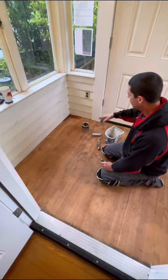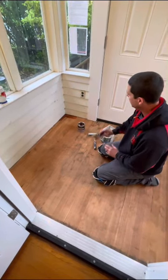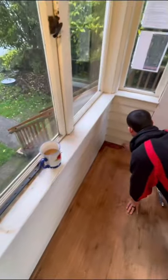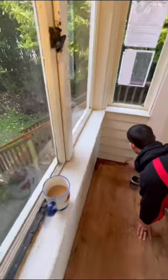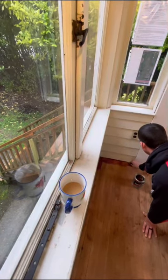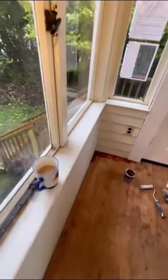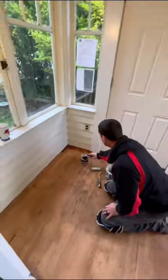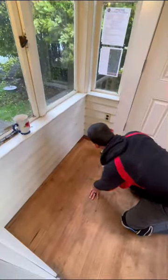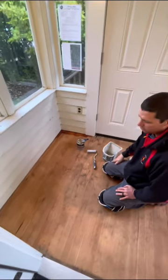The way you do this is you put down one layer. I'll start on the edges — as you can see I've done here — and cut it in with a brush, right up against the edge so it's nice and clean. I don't want to get any on my wall or trim. You'll do a row like that, and then I'll come with my roller and roll in all the big bulk of it. That's how you do the first coat.